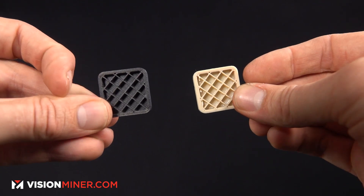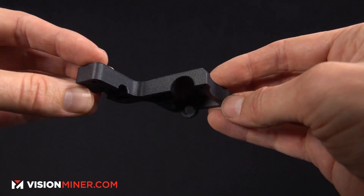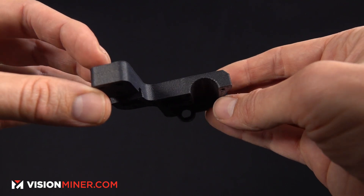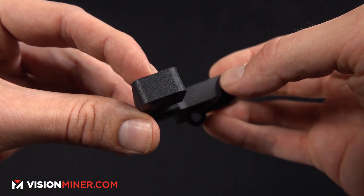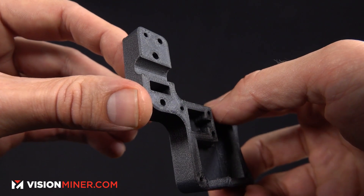Pricing is generally about the same — you get a little less PEEK and more carbon in there for roughly the same cost, so it's kind of a wash. You get more accuracy, less difficulty removing parts. It almost hides the layers — you can print at 0.25mm layer height and you won't even see them. In fact, they recommend it, and it's easier and faster. PEEK is really, really good.